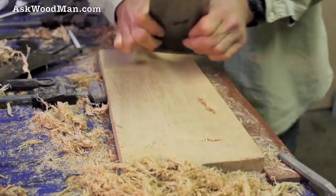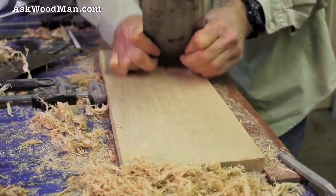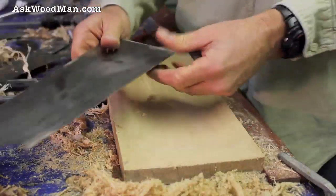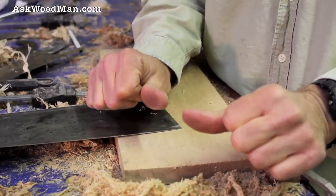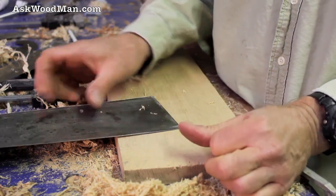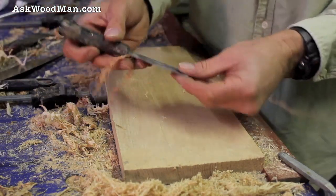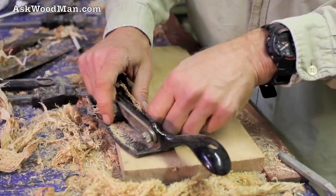That end is really nicely hooked, but these just take a toll on my thumbs — I've jacked my thumbs up holding them in that position even with gloves on. I just don't like to hand scrape unless I absolutely have to. That's why I prefer to use the putty knife technique or the Stanley number 80. Let me float this out a little bit more with it.